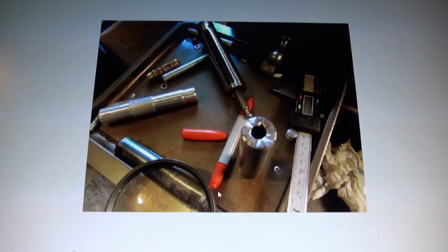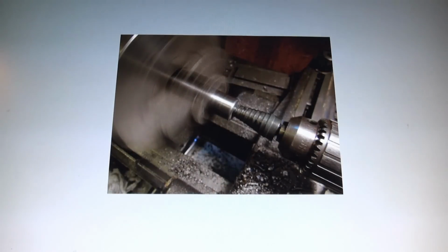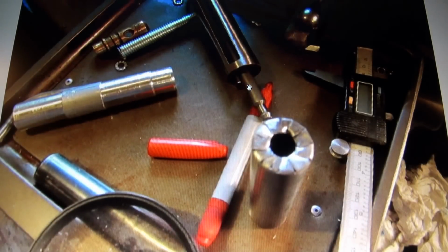Now we have to make a piece like this to go inside here and make sure that all this stuff on the inside is perfectly flat. And the hole wasn't big enough. And the other thing about this galvanized steel pole is that it was actually strong enough. I had to bore that hole open right here because this Chinese piston stem is actually fairly thick. It's nice and heavy duty. The whole thing is really nice. It's amazing what they put into their rifle. I bought that rifle for $49 at Midway USA, a refurbished Air Hawke.